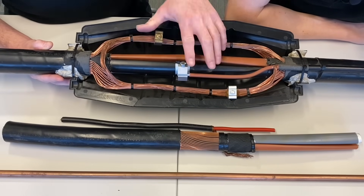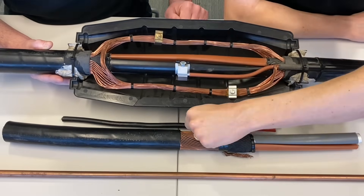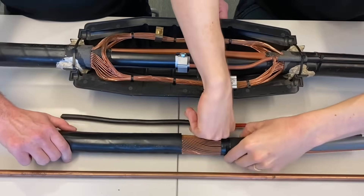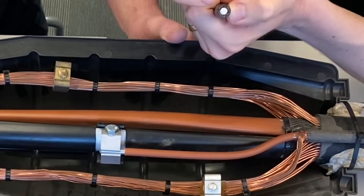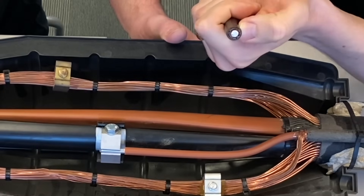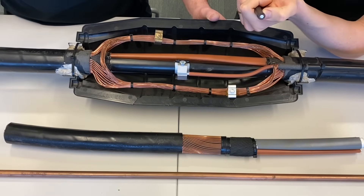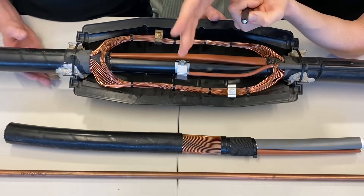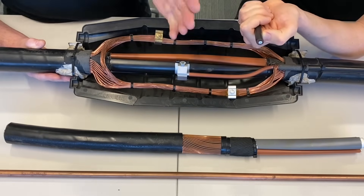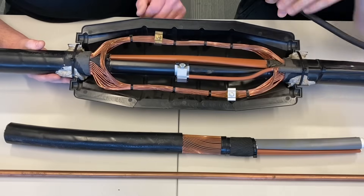Under this system, we don't need to stake our combined neutral earth because we don't believe we're going to lose it. The cable goes into the installation and feeds it. The design of this concentric cable is important — the combined neutral earth conductor is wrapped around the line conductor. So if someone were to cut through this cable, they would cut through the line conductor first before breaking the combined neutral earth. They'd have either shorted the system or disconnected the line conductor, leaving the combined neutral earth until last. That's another reason we don't need that stake along its length.